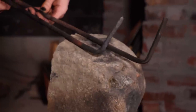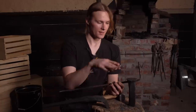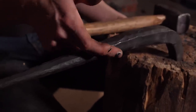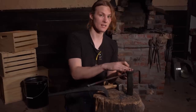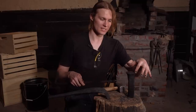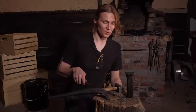You can definitely see more little dents and dings in the one made on the rock, and it's definitely not as flat. This is a fairly common setup — a stake anvil and a separate horn — because it's easier to manufacture. A lot of these parts can do really specific things you can't do on a block of steel or a rock. You can use the horn to concentrate force on a smaller area or as a guide to make round shapes. The edges where they're mushroomed out let you part off pieces without needing a hot cut chisel.